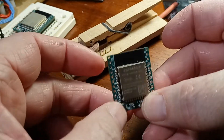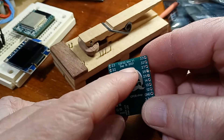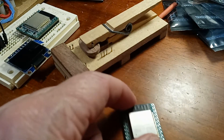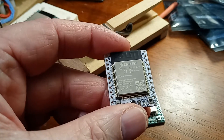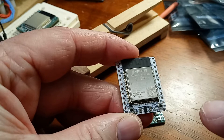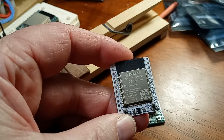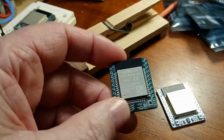So this is the V1, which is the original mini that we've been talking about for a long time. That was from last September, and then I did a lot of testing on that — there's one over there I've been fooling around with. Then I made this V2, and the V2 is basically the same as the V1, but it has more capacitance. There's a regulator right down there, so you can put 5 volts in and it will regulate it down to the 3.3 that the ESP32 needs. I added bigger capacitors and a few extra capacitors in this V2, but the V1 runs just fine — that's what I've been working and testing with.